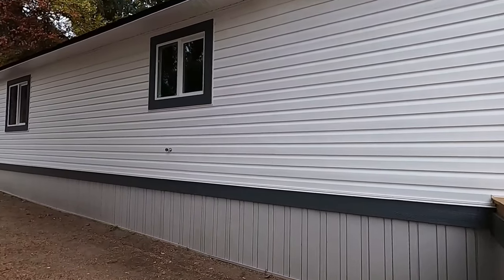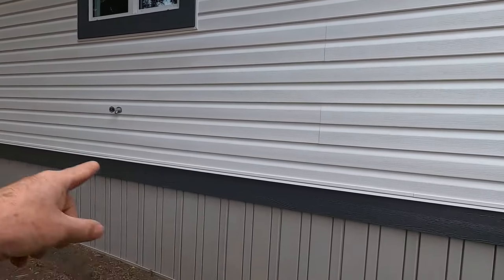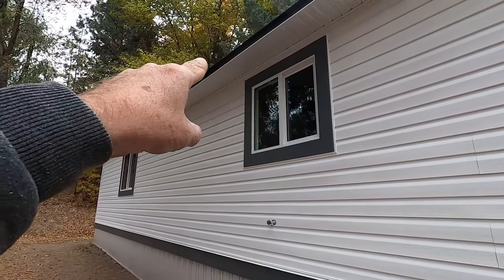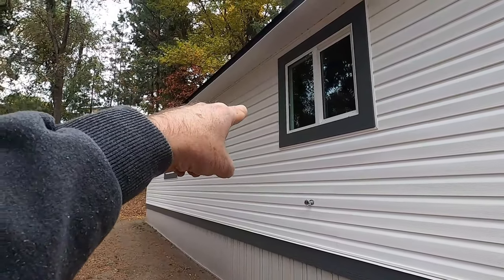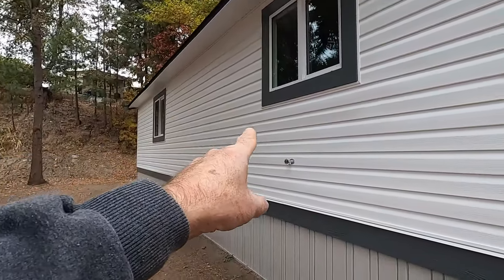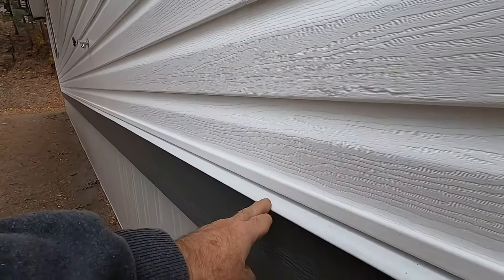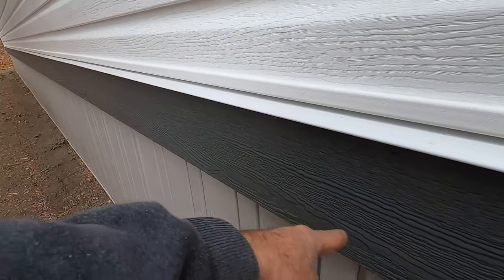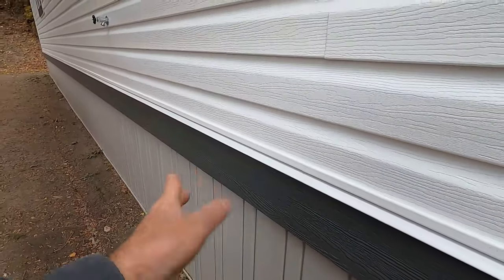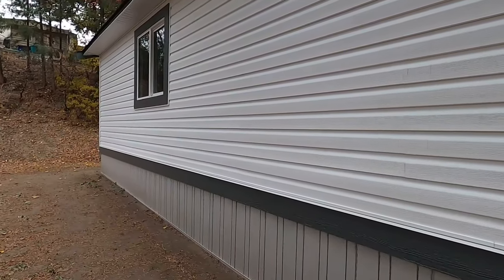Now you can see how we're finishing here. Before, we were having trouble with a lot of rot in this rim joist, and I showed you how I fixed all that. That rot was due to water running off the roof and down in behind the old tin siding — the old roof didn't have the overhang on it. Now with the overhang and eaves troughs, the siding comes down over top of this drip edge, which goes over top of our trim board. Any water that comes down the wall now is going to be directed out and over. We'll have no more problems with wet walls. No more rot — that's a thing of the past. This just takes it up to a residential style, like in a regular home.